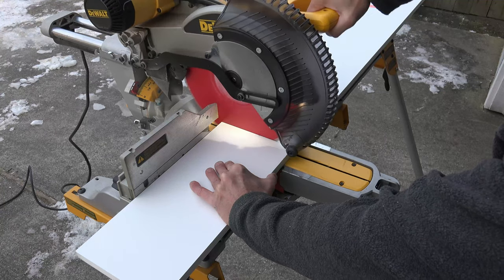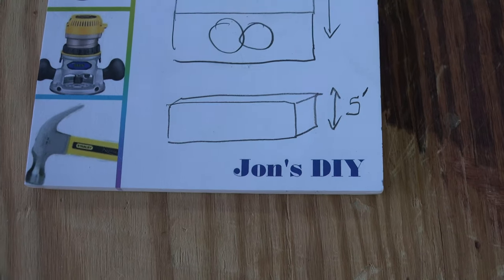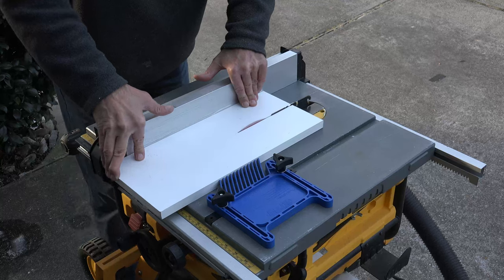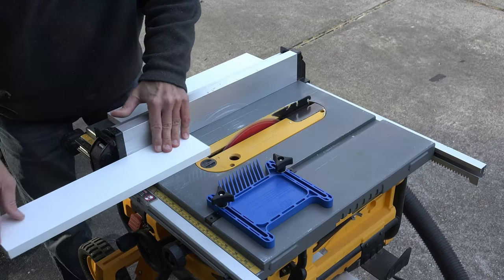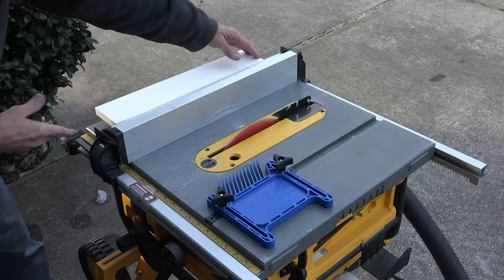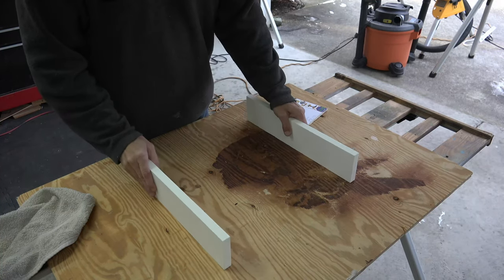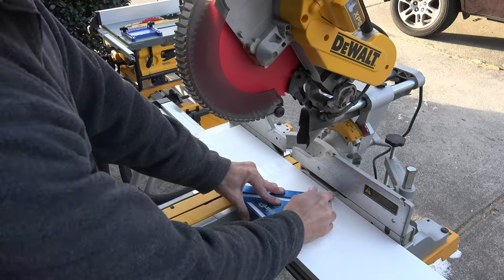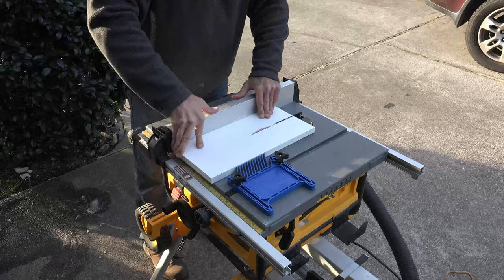Do not ever trust the measurements on the guide — this stuff cuts like butter, so take your time and be slow. I forgot to add the height of the box; he wanted the new one to be a little bit higher than the old one. Cutting the board perfectly in half will give me four inches, and with the added top and bottom of the box we will be just a little over five inches. Remember this piece was eight inches, and also remember to run both sides back through to ensure they are identical. Now we have our front and back pieces. To cut the sides, just like before we make our marks, this time at fifteen and three quarters of an inch, use our speed square to align it and then cut our board.